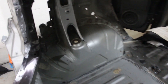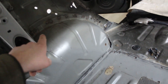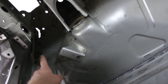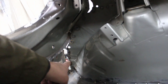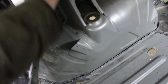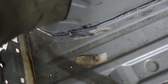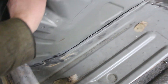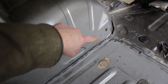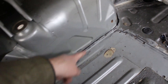Okay, good progress today. Got the spot welds done all the way around, up beside the shock absorber support, and around underneath there. So the two pieces of the wheel arch are aligned with each other — the inner wheel arch and the outer wheel arch, which is existing. I just have to weld it now to the floor pan; it's still not fixed to the floor pan. So that I'll do tomorrow — it shouldn't take too long. I just need to hammer that to meet the curvature of the floor pan and hammer that wheel arch that way, then it'll all line through. Progress is good.